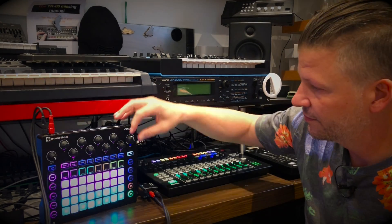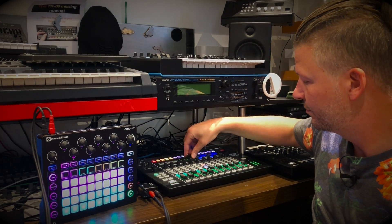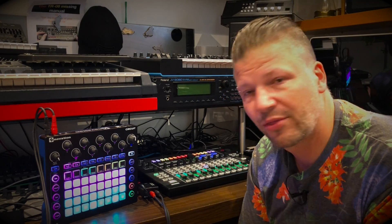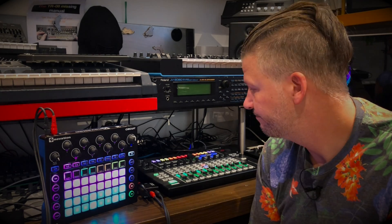I bring the volume down and I have signal — great. So this little box was about $30 Canadian, which is cheap. The only issue with a no-brand box like this is it's fixed at one sample rate. You might want one that has a switchable sample rate — 44.1, 48, or 96 — or automatic switching depending on what it receives or sends. Now I have two extra inputs on my mixer. See you soon!